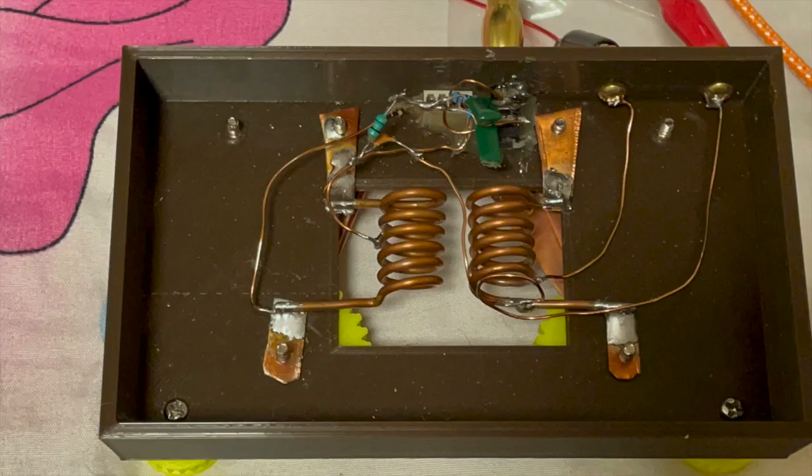This is how it looks under the case. We have the variable capacitors, terminals that are the M3 screws screwed into the copper plate, and I connect the copper plate directly by soldering to the coil. This is very important because you can't use very loose wires or long wires to connect the LC circuit together. They must be soldered together to attain the highest Q factor available. Otherwise the FM circuit will lose everything and you can't hear any radio.